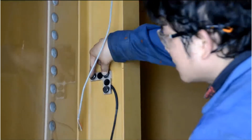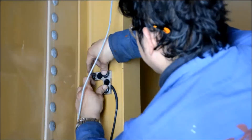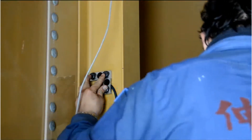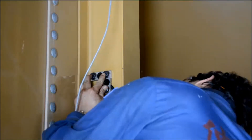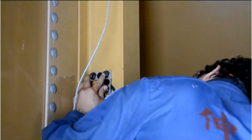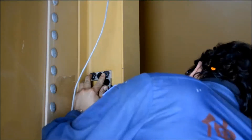Here you see the placing of the sensor onto the mounting holes. The washers and nuts are being assembled on the back side of the beam. Before the Loctite starts to set, which takes a minimum of two minutes, slide the sensor up, down, and sideways to locate all the bolts in the centers of the mounting holes. Once this is done, tighten the bolts about one-sixth of a turn more than finger tight to ensure that they don't move while the Loctite is bonding. Then leave it at least for half an hour.